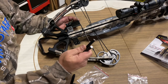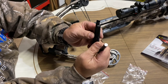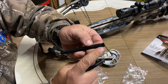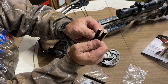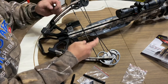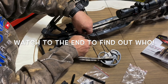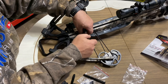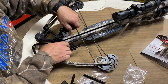Back from the workbench — you can see on the longer rods how they had the groove, and then on the shorter rods we cut off the tops. They have grooves for the dampener so you can see how they work. They were very simple to cut — all we used was a hacksaw, then filed the tops down to remove any burrs. Now we'll insert these back into the bracket and take them all the way down to the ends so we can fine-tune it.